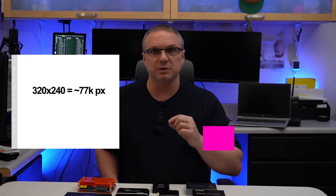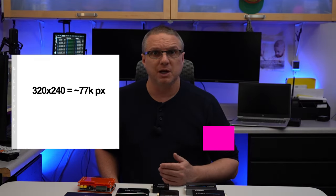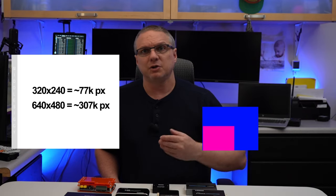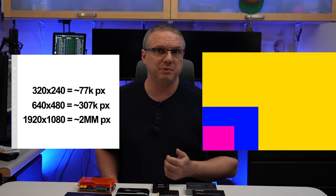When you think about resolutions, an NTSC analog signal — which is what old TV broadcasts and VHS tapes contain — can be as small as a 320 by 240 pixel image. That image is roughly 77,000 pixels. If we increase the size to 640 by 480, we go to roughly 307,000 pixels. At 1080p, which is 1920 by 1080, we're talking over 2 million pixels. At 8K, it's over 30 million. So going from 77,000 pixels with the NTSC signal to over 2 million at 1080p, there's a lot of missing pixels that need to be guessed at in this process.